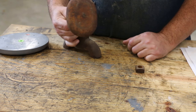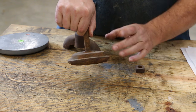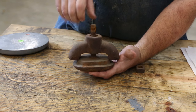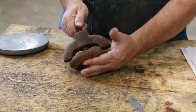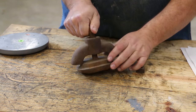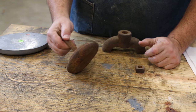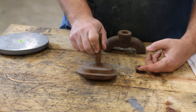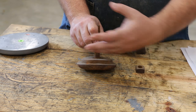Because it's oval, you can go in this way, down to the bottom, pull it up in there, and it seats around here with a gasket. Then you drop the little wing over it, tighten it up, and it pulls tight from the bottom. As the pressure on the boiler builds up, the pressure is pushing out on this, so that's the reason you want it kind of on the inside coming out. This one actually has some curve to it because it was made to fit the curvature of the boiler.